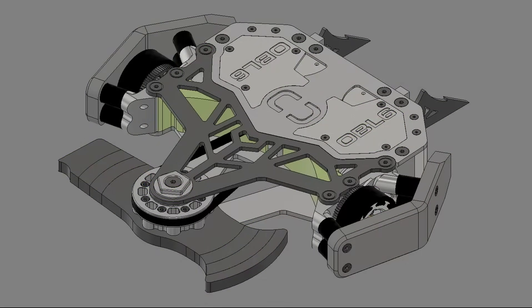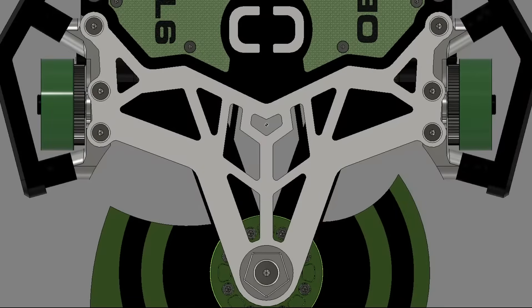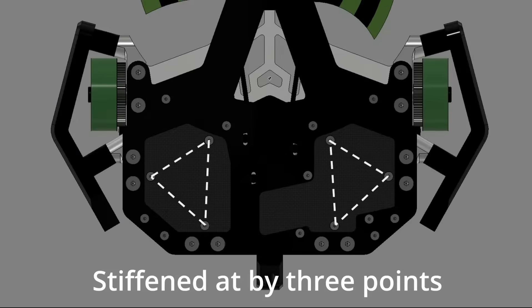This variant moved away from the dual aluminium weapon support for a composite of both aluminium and Hardox. The Hardox should be able to handle out-of-plane forces such as a vertical spinner hit, while the aluminium is a lightweight solution to the usual impacts from its own weapon. This Hardox plate has rather complex pocketing which looks cool but is definitely not structurally optimal, though I decided it was worth the trade-off. The lightweight carbon fibre plates add stiffness to the heavily pocketed frame but need to be kept out of the line of fire.